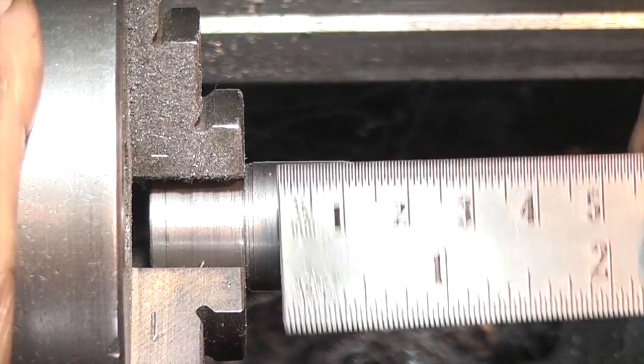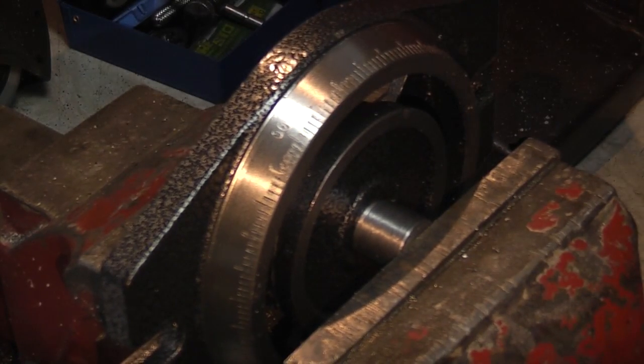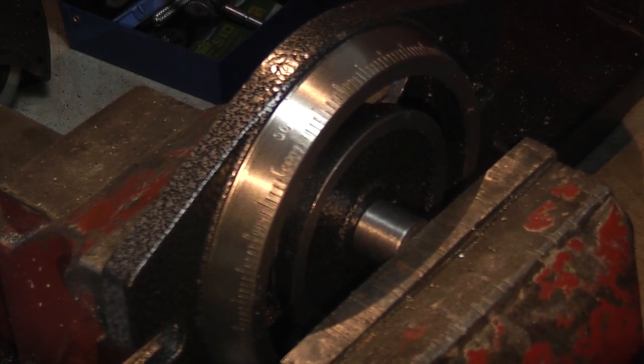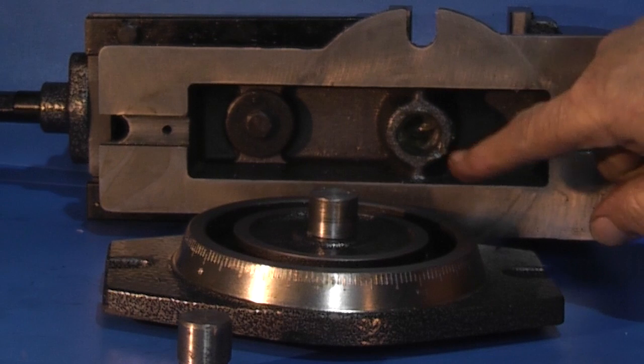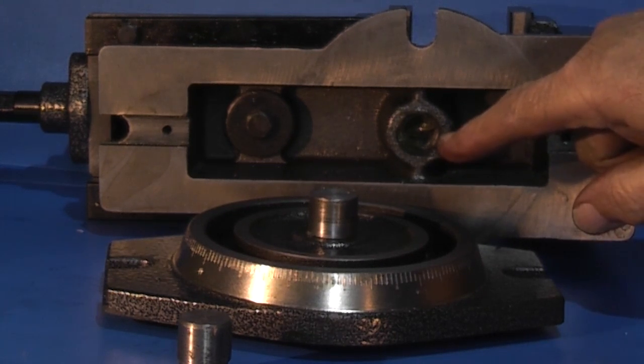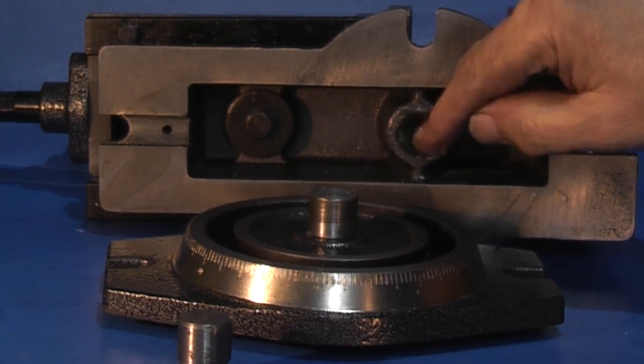Turn this round in the machine. I'll just put it in the machine. I've pressed it into the base. I've put some grease in the back of that hole because I think this hole is oval — the new pin goes tight and then loose, so I think this hole is oval.